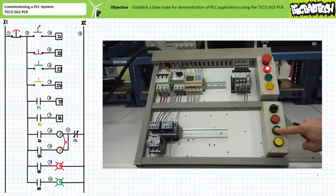Finally, when only the normally open momentary contact yellow push button on input 4 is actuated into the closed position, output Q4 is energized and the green pilot lamp turns on. Additionally, output Q3 remains energized and the red pilot lamp remains on. Everything seems to be functioning as anticipated for normal operation.